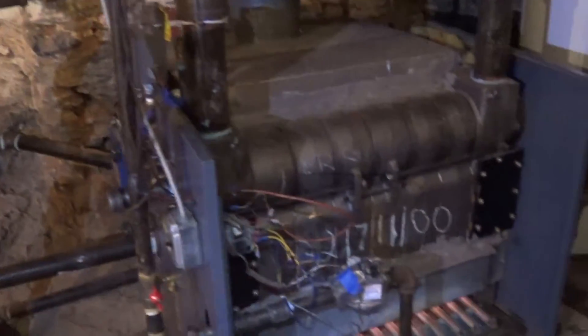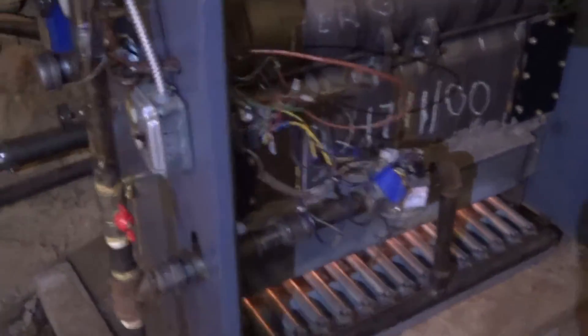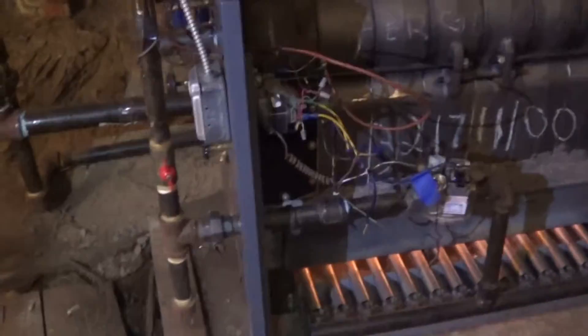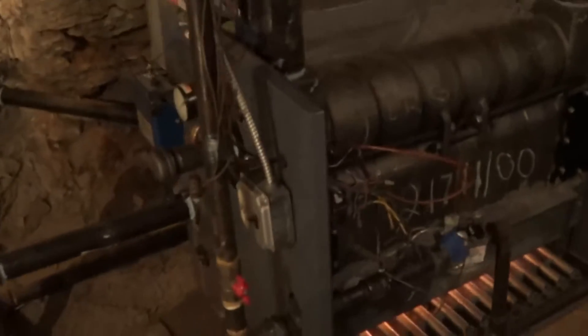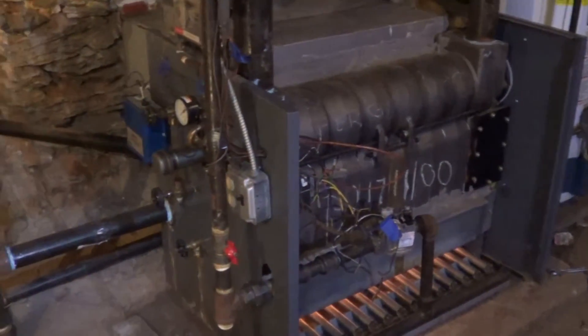Got the boiler fired up now. Still got to do a few steps on it. First of all, no leaks — everything is good. New condensate line here. Verified all the safeties are working. We have to skim — first thing we got to do is skim the top of the water and do that for about 30 minutes. And that will pull the oils off that would be on top of the water. Then we're going to go on to chemical treatment to keep the oxygen down, which is why the old boiler failed. And it also maintains the proper pH, which is going to be about 9 to 10 — very alkaline water. And then the boilers will last 50 years if you maintain the water quality in them.